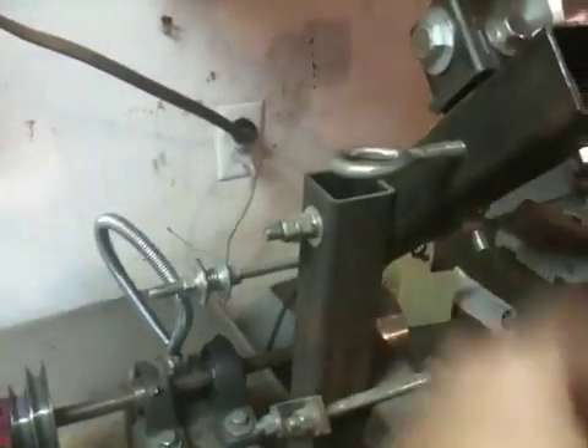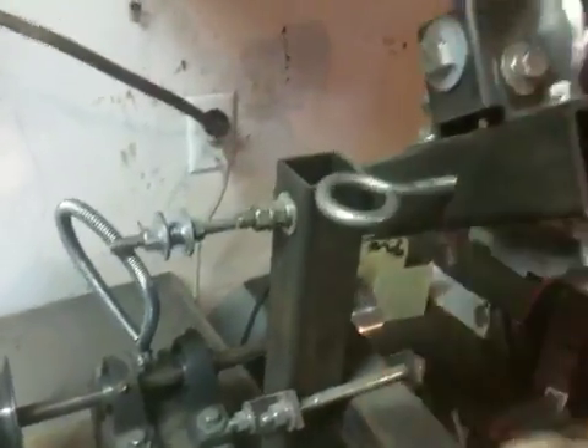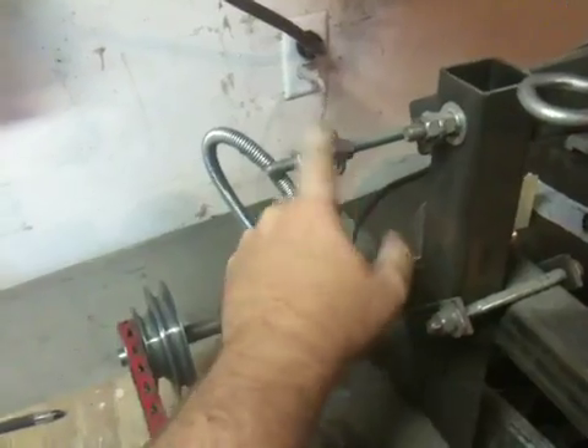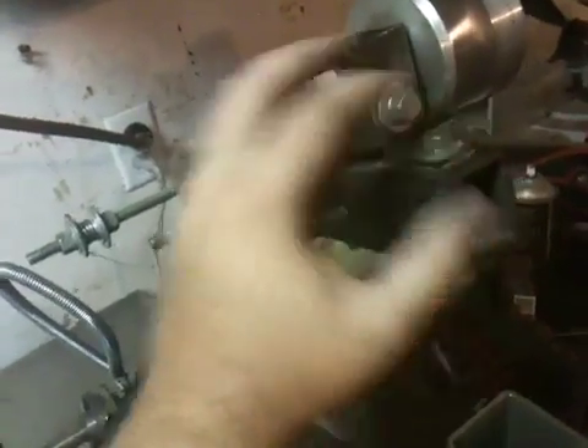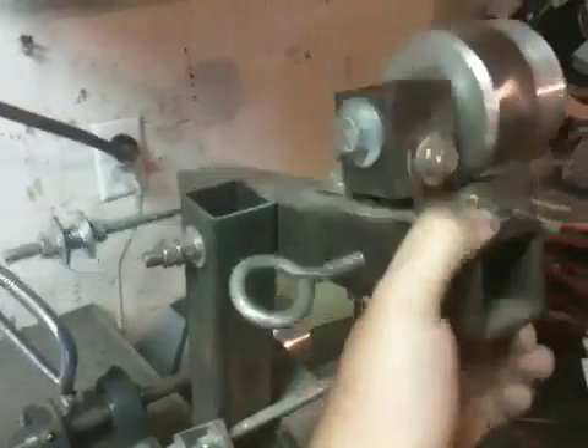And if you take this off, you can kind of see how that sticks a little bit. Ideally, it would be kind of free spinning — I wouldn't be able to hold it up like that. So I'm going to replace this with a half-inch threaded rod. I'm also going to move the spring holder a little bit closer to the tracking arm, just to decrease some of the leverage that's pulling down on that, and hopefully transfer more of the tension to this arm. And I'm also going to grease this pivot so that hopefully it's not sticking as much — I think we're losing some tension through that as well.